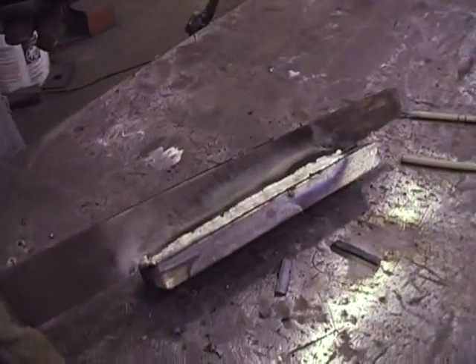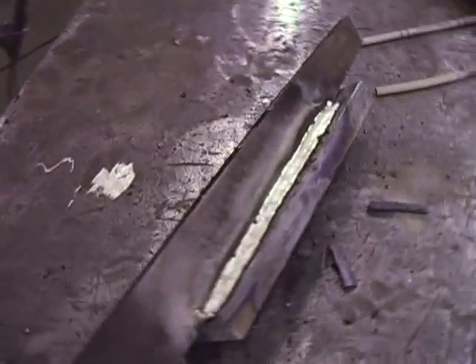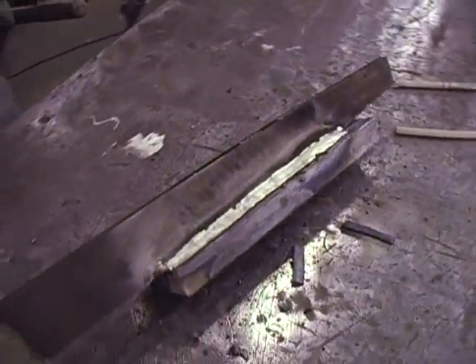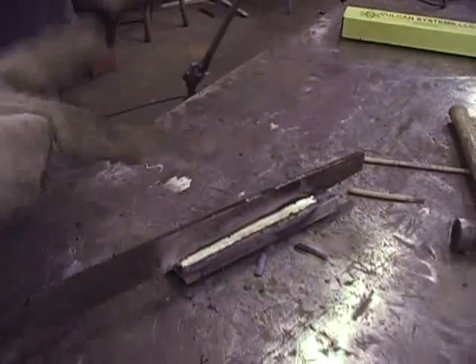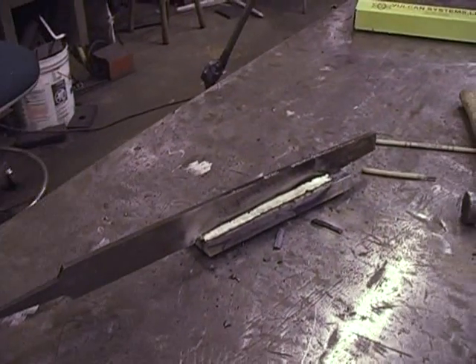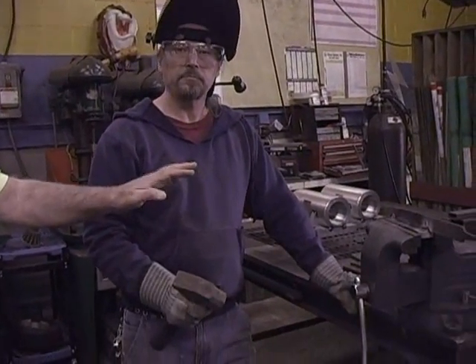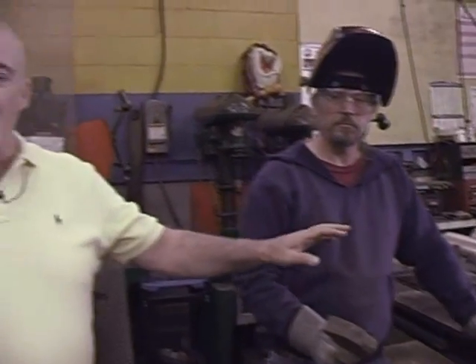There we go — it's got a really nice bead. Take a look at that bead. There's no motion at all in the weld itself. Now let's take this over the vise and put the big hammer to it. We've got it in the vise here and Tom's going to start hitting it with this hammer. What we're going to demonstrate is the weld is soft and strong and ductile — it's everything you want. The weld has no carbon in it. It's not going to be hard. It's going to be machinable, and we're going to demonstrate that here.